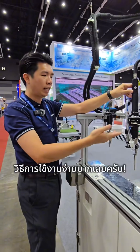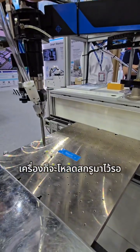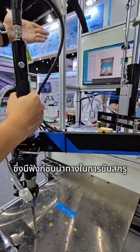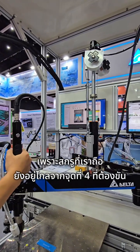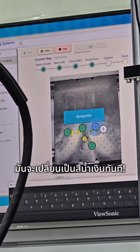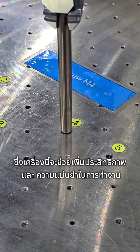How to operate it is quite easy. If you follow along, just raise it a little bit, trigger the I/O, and it will reload the screw here. You will see we have a navigator function. Right now the indicator is orange because we are far away from the point we need to go to tighten. When you move the screw to the right place, the color will become blue — that's the right timing to trigger the lever and do the tightening.